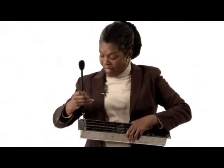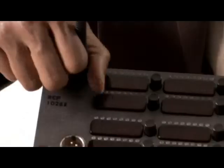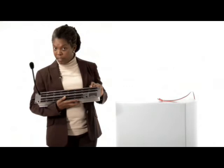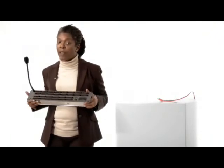I haven't shown you the most important part of an intercom system, the user interface. With Riedel, you can choose between different series of high quality and easy to use panels. Hey, and just look at the design of this 1000 series panel. Isn't that cool? Only 56 millimeters deep, with individual listening level controls for each key, an 8-character LED display, which can be seen in direct sunlight, and guess what? The audio quality at the panel end is digital since we're using the AES format.